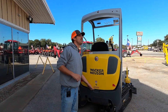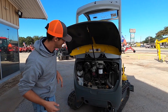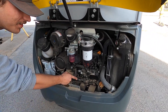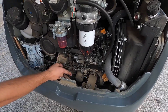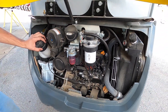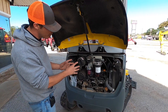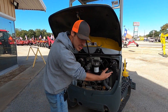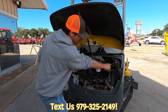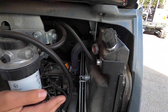I'm going to open up the hood real quick. Your fuel filter and everything is right here — it's easy to access. Looking down here you've got your oil filter, your oil fill, your dipstick, your diesel fill, and your air filter. Everything is relatively easy and straightforward to access. Here's your coolant fill and there's actually a little sight glass right here so you can see how much coolant you have in your system.